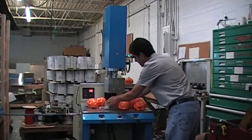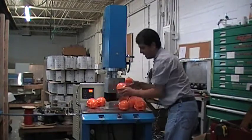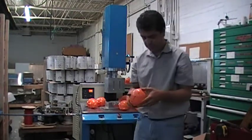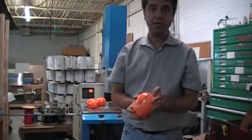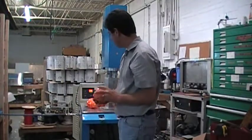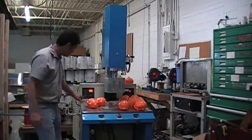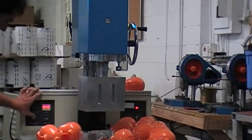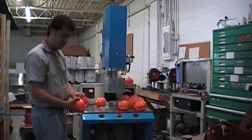As you can see, the jig needs to be fastened with clamps, but I'm not doing that now because I'm still setting up and testing the machine. This is an over-weld — we're getting too much welding at 0.6 seconds. I'm going to go down to 0.4 seconds and put another one in.